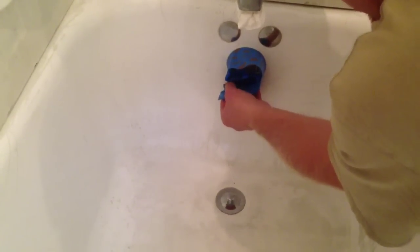When refinishing the tub, the most important thing is the prep. Here we're using triple-aught steel wool, and we're going to do this three separate times with a cleaning in between. The kit that I purchased comes with steel wool and a cleaning solution. You can also use TSP, which can be picked up at the local hardware store, usually in the paint department. We're going to rinse it out with the cleaning solution and use the steel wool three times.